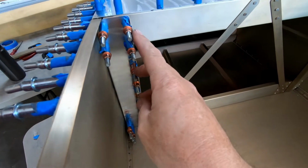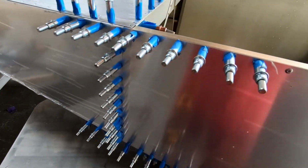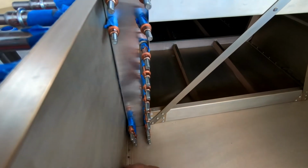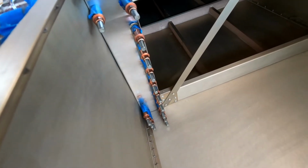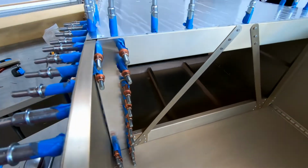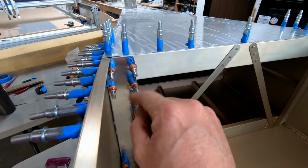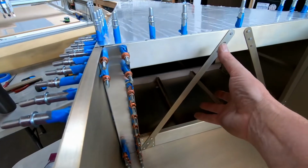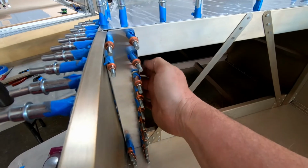All right, I've got all the rivet holes that were already drilled put back into this new frame that I'm installing. I've got the bottom fixed, so if I take the skin and push it up against the side, the gap that was there between the skin and the angle goes away, so that's good. What I'm going to do here, though, is take advantage of the fact that I don't have this permanently attached to this frame right now, and take the clecos out of the corner and pull the other three quarters of the frame out, leaving this piece attached to the rear fuselage here.